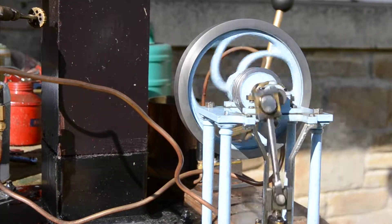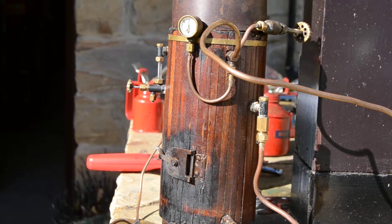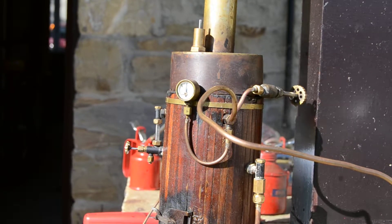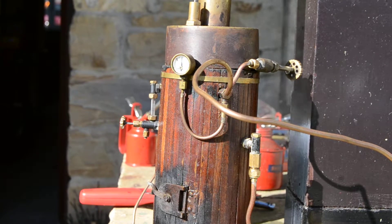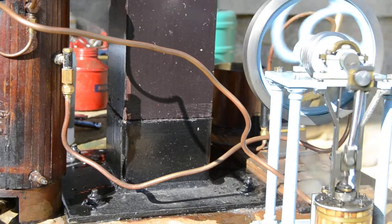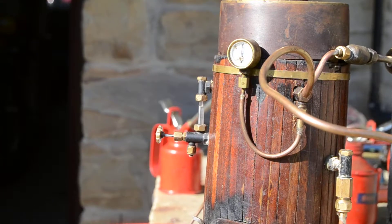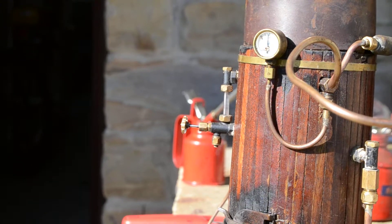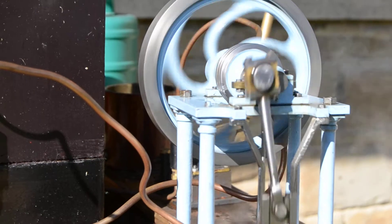As you can see, the engine is now running reasonably fast — probably a couple of hundred RPM — with the boiler pressure at about 50 pounds, but the valve is virtually shut; there's only a bit of steam sneaking out of it. What I'll do in a minute is try to get the pressure to creep up a little bit higher, then fire the engine for a short blast at quite high pressure to see how fast the little engine will run. The water gauge at the moment — you can just about see the air bubble near the top.